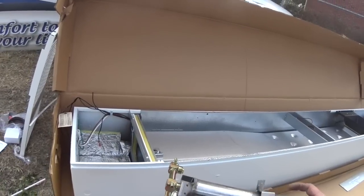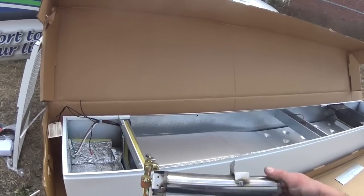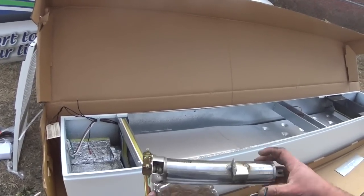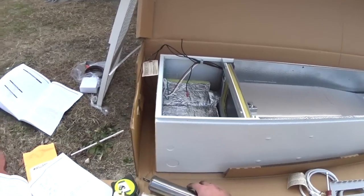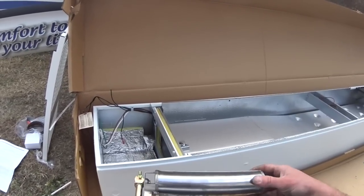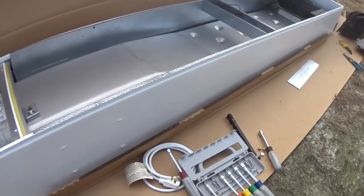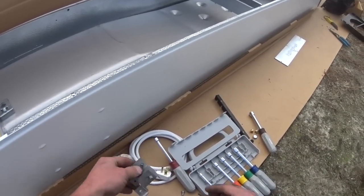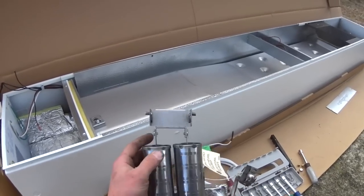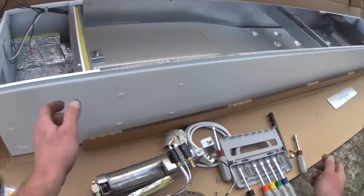Go ahead and get our burners back on. Thread those on. We need our pilot to end up right about here, and it won't go another turn, so we'll back it off, put that there. Get our other burner, bring that one in, and that one won't go any farther, so we'll back that off there. We'll get our mounting bracket back on. I think that should do it. If we need to, we can make adjustments when we go to put it back in. I think I just used the wrong screws.